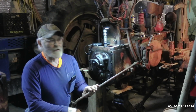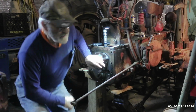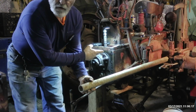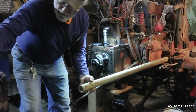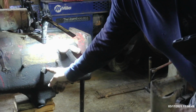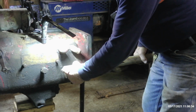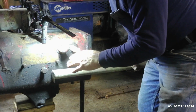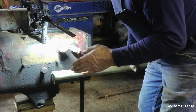I was fortunate enough to have my son over here, so what we did on this one, being it's inside the shed and on the concrete, is I took a piece of pipe and cut it so that it rests on the transmission housing back here, or the rear axle housing, and this end lacks just a couple of inches of coming in contact with this large 7/8 bolt coming out the side of the torque tube. I was able to place this up here like this, and then take a porta-power and set it right in between these two, and we're able to control the push, so to speak, by just incrementally applying pressure to that porta-power, and it just gently popped loose. Then we went about the business of shaking it apart.